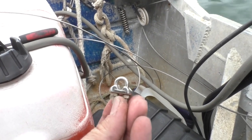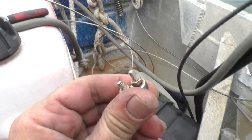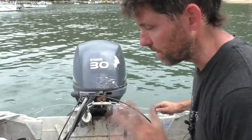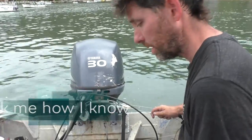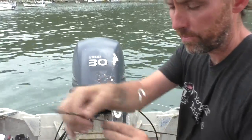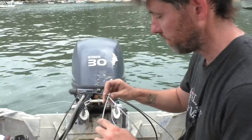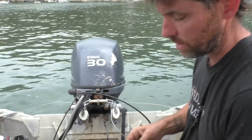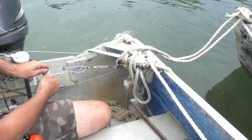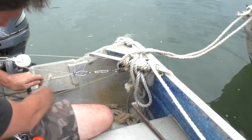To lock it off I'm just using a couple of U-clamps — I'll go around the turnbuckle, fold it back on itself, pull it tight, and then do the two nuts up. I've got a bit of excess cable here but I'm not going to cut that off until it's all rigged up and ready to go, because nothing worse than it being just a bit short. The first thing I'm going to do is feed this little locking clamp on, then I'll go through my turnbuckle, and then I'm going to go back through this clamp. Then I'm going to hook this onto the spring and start pulling this cable until it's reasonably taut.